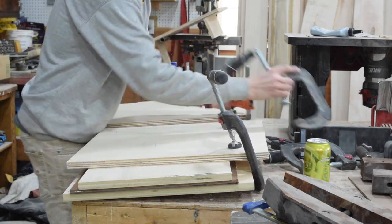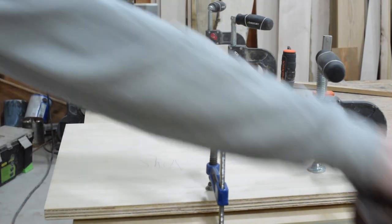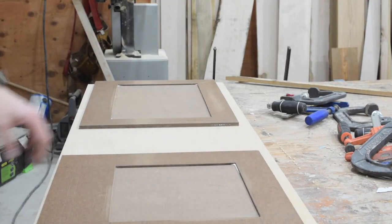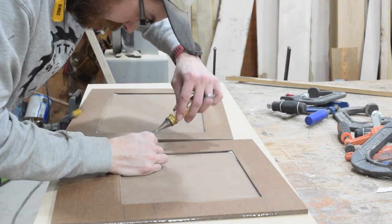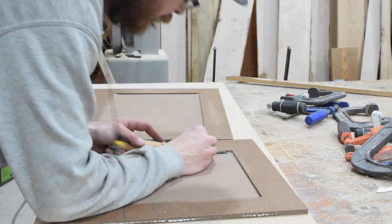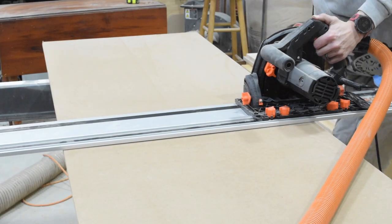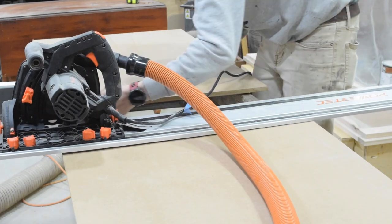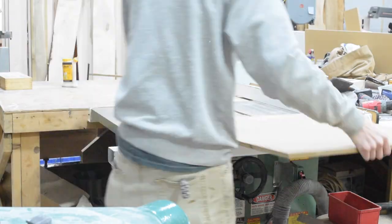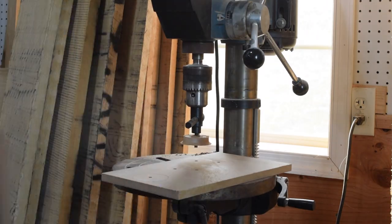We'll pop these raised panels out of the clamps — there's a little bit of glue I'll need to cut out of the corners — but I'm very happy with how these came out and how they look. A little bit of paint on them and they are going to be phenomenal. I used the 15-minute quick-and-thick Titebond, which is why the glue is white. Now we have the panels and the cabinets, and part of the build is going to include recessed inset lighting in the underside of the upper cabinet.